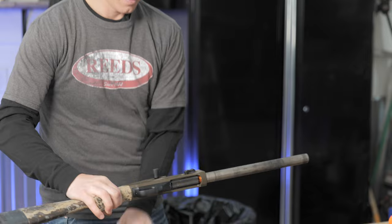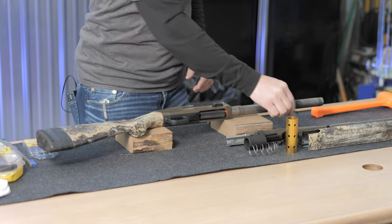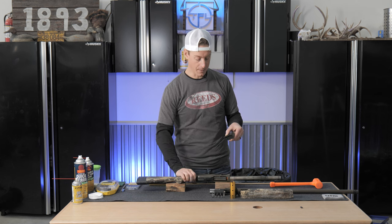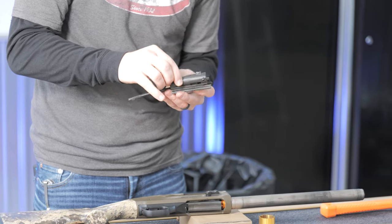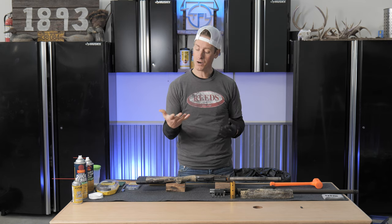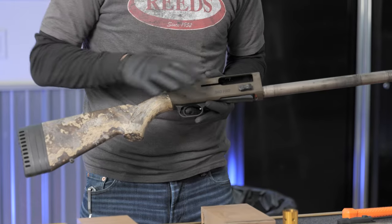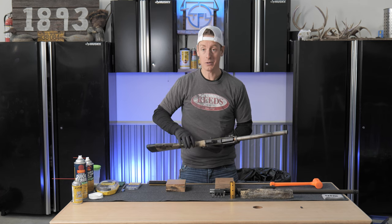We got the barrel and all the gas portion off the gun. Now we need to take the trigger group and bolt out — pretty easy, pop that off. Most gas shotguns are going to be similar. Today we're taking apart a Mossberg 940 Pro. One thing to point out is there are some pins in the bolt that are encaptured by the bolt, so you've got to be careful or you might lose some pins. And I've already messed this video up — the number one thing I like to do, other than checking the gun is unloaded and safe, is put on some gloves. This job is a messy job and I don't like my hands smelling like gun cleaner with carbon all over them all day.